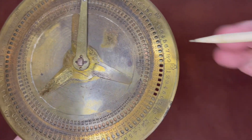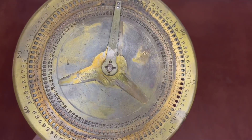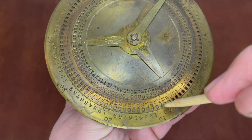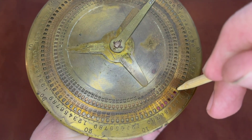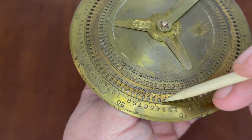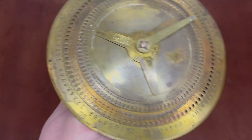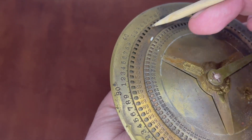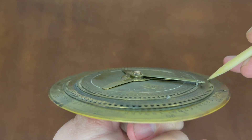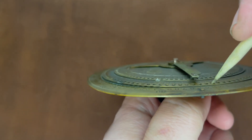The numbers can be a little hard to read and line up, but to add, the user stuck the stylus in next to the number they wanted and rotated it counterclockwise. The user only ever rotated that middle ring. The center ring was only ever rotated to clear it. Here I'm adding some numbers — you rotate it till the stylus slips and stops. As the middle ring rotated, a cam would rotate with it. From friction, the center ring wanted to rotate but was prevented by the stationary arm. Once that cam rotated around, it hit the stationary arm, allowing the center ring to advance one space.